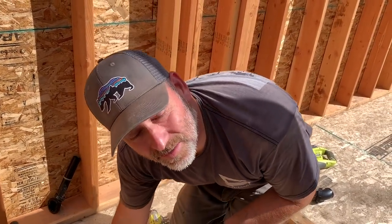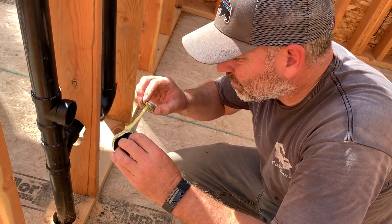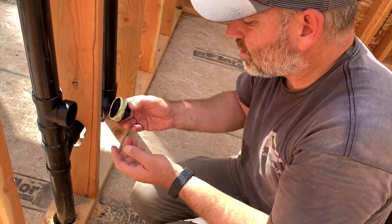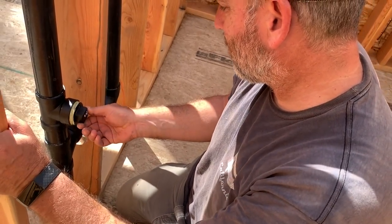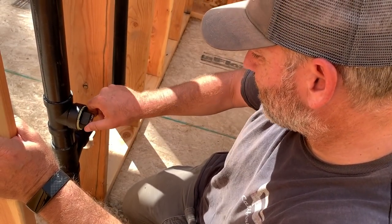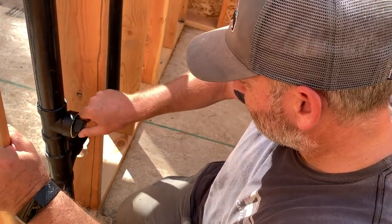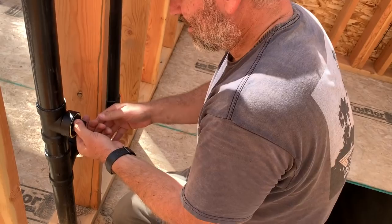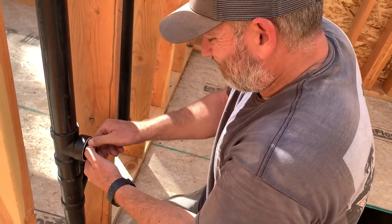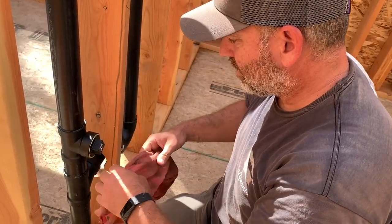Oh yeah, we gotta do the clean out on the laundry. And it should never have to come off. That's why we're not using it where we put those caps on, because that's all temporary and that's gonna come apart. And then we're gonna put the P-traps in there and tighten it up. And I don't want a big mess of yellow stuff in there. So, just gonna use it on these guys here. Guess that's it.